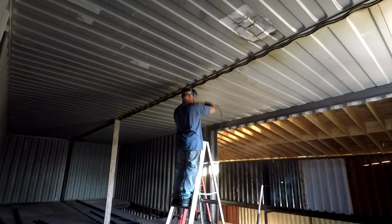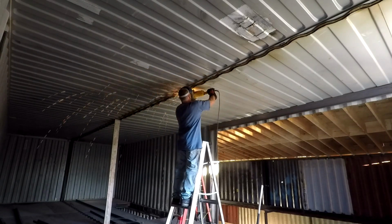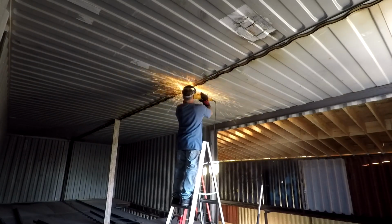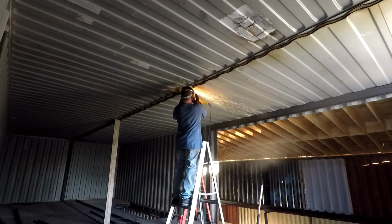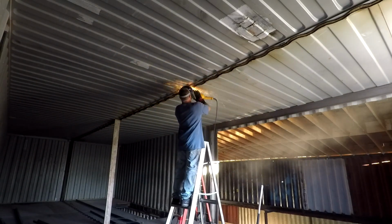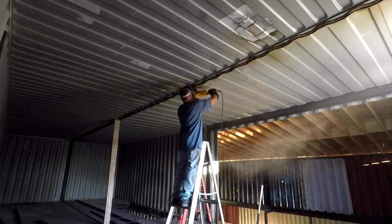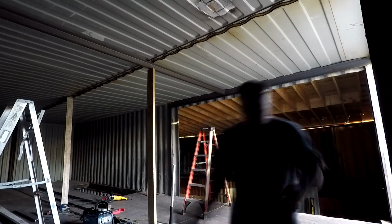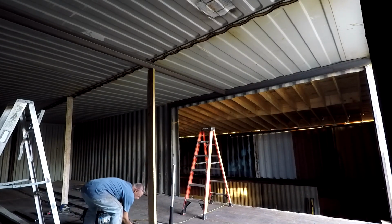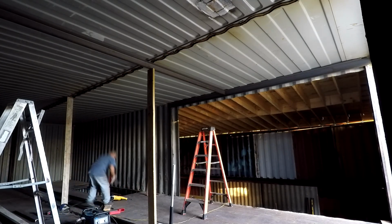So intermixed with the ceiling, I'm doing the structure work on top. This is where one of the main beams, one of three, go across, C channel rather, into the 6-inch C channel that's above the opening, and then I bridge two more further down. I basically do them 10 feet apart in the containers. Now it's sufficient for managing all the loads on the roof, etc. You'll see me using these wooden jacks. I'll extend it past what it should be and then let it down, and it'll settle down on the C channel just fine.